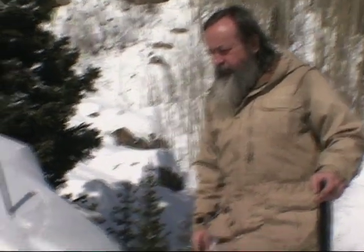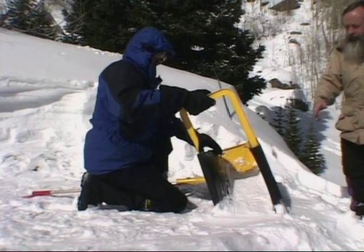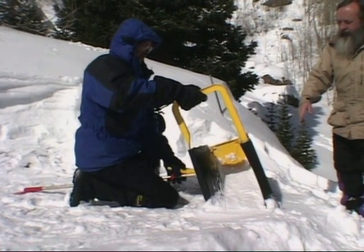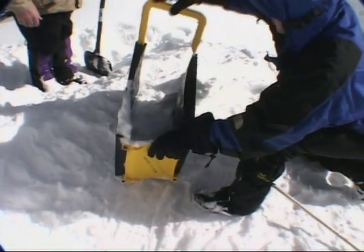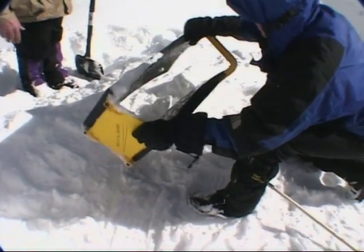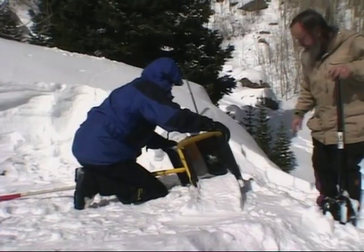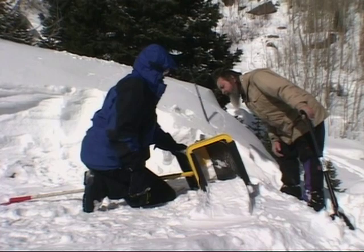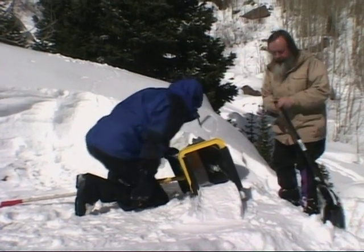Okay, Guy, go ahead and move the form. First he pulls up the toggle, the U-bar, then he releases the toggle so that the pole gets loose. He slides it along, takes it all the way off, pushes the U-bar back in, the toggle resets itself, and he puts it back on the form. And I need to go over here and look at the square to floor line and tell him to tip it just, there you go, that looks good.